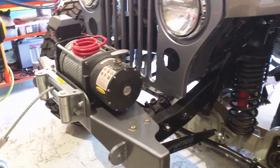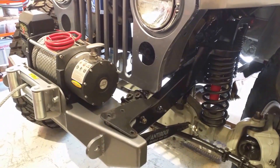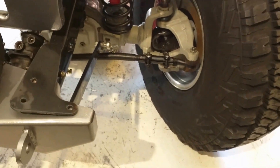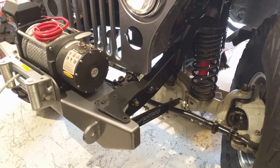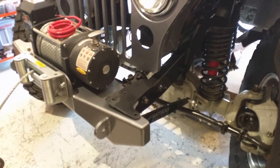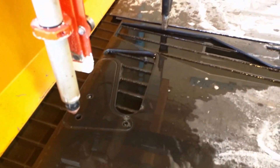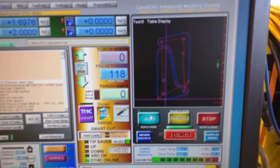What I have now are some extensions that attach onto that bolt plate, and a hoop comes out and travels down and attaches above and below. This is just a reinforcing plate to hold the hoop. There's a hoop on both sides, and it'll be built of tube steel. Then the bumper will be road legal. So that's the first cut — I have four more components to cut, and it'll be cut completely out of this quarter-inch plate. The design work is 99% of the time. Here we are with two more parts ready and four more to go.